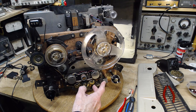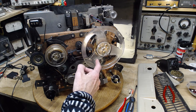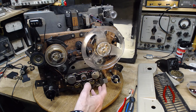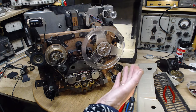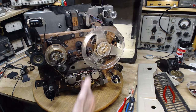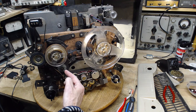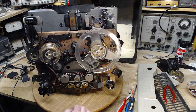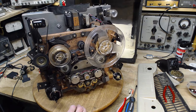What that tells me is whatever this motor is doing, this one should be doing too. What is it doing? You turn the unit on and this motor runs — it just runs and runs. It's very typical in these old tape recorders that the motor is just always running; sometimes in neutral when nothing's happening, it's just running in neutral. By symmetry, that motor always running means this motor should always be running too. That's what I concluded — and of course the motor over here doesn't run.